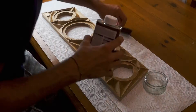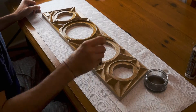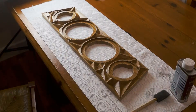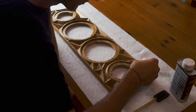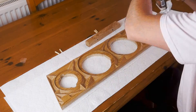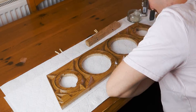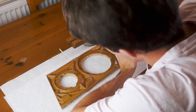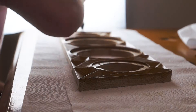Before laying down the first coat I go with white spirit — it's recommended just to make sure any remaining dust is gone. Then using a foam brush I do one quick layer, and a few minutes later come back and dab anywhere where it's pooled, because you don't want too much or your finish will be all plasticky. I did a total of three coats; I only did two on the feet purely because I forgot, but you barely see them so they look pretty much the same.